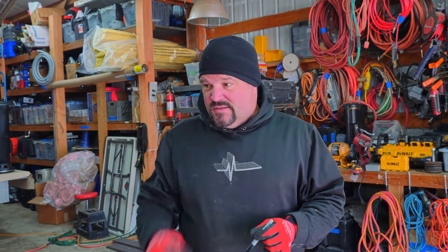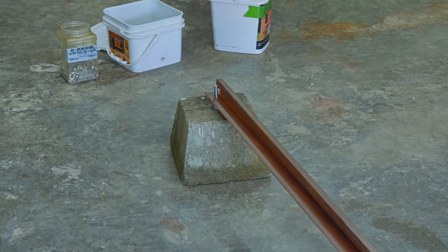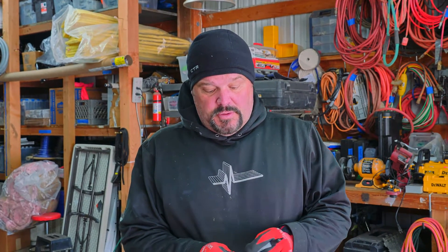So what I have here is a quick way for you to create a jig. I'm going to show you how I draw it out on a piece of plywood and we'll go from there. What you need is a way to pivot — you need a pivot point. So what I have here is a pin stuck in a footing block and a piece of metal with a hole drilled in it to use as a very large compass. This is easier and more accurate than dragging a tape measure around the circumference, which I've done hundreds and hundreds of times.